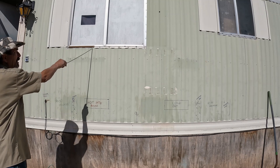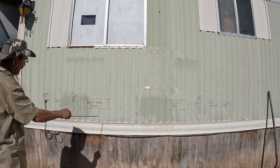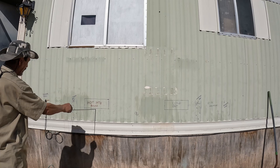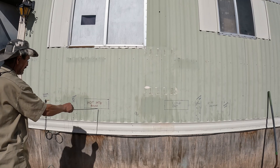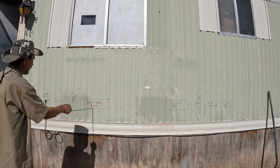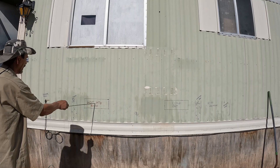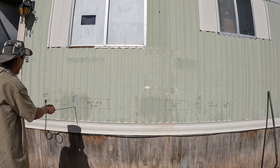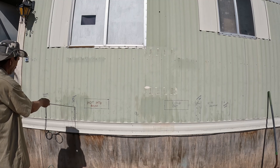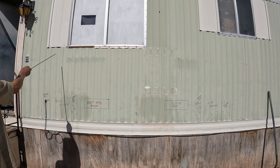So this will be my exterior wall. I'm going to do a pop-out, but I'm going to keep it below this window. The tub will finish out somewhere here — probably about right here — and the height of the top I haven't established exactly yet, so let's say the height of the top is right here. Here's the hot air into the house, exterior wall of the box that holds the tub, R50 insulation, exterior wall of this pop-out.